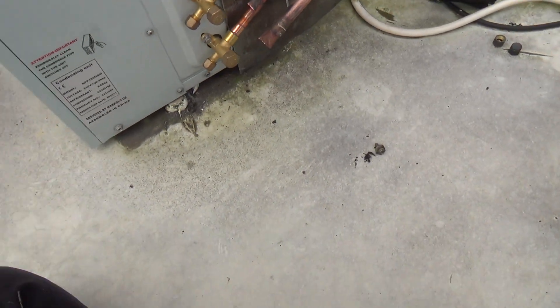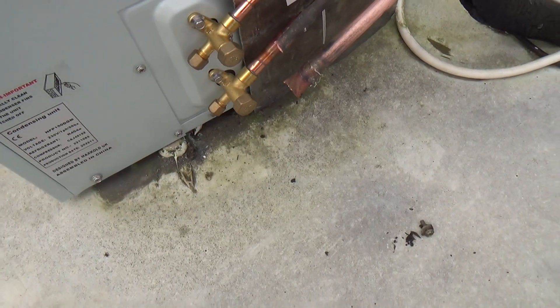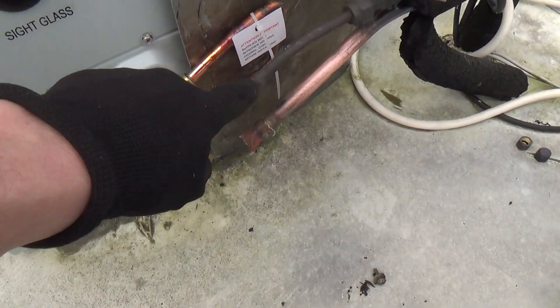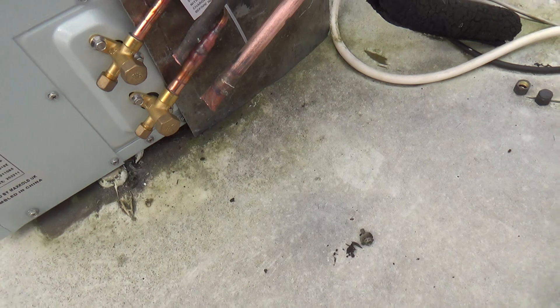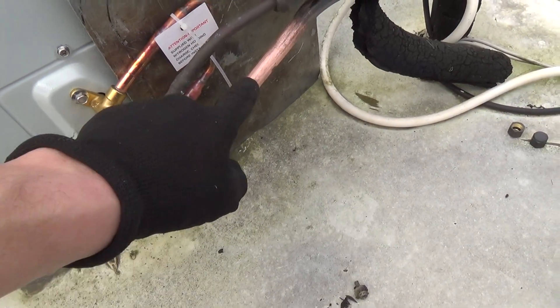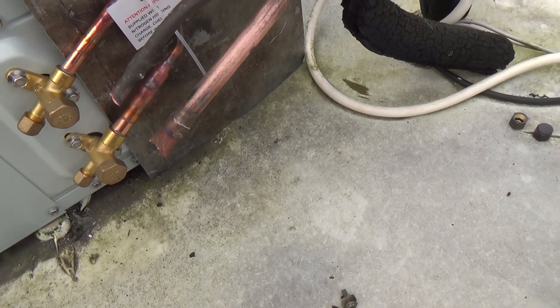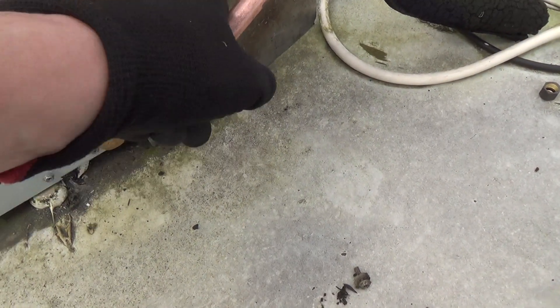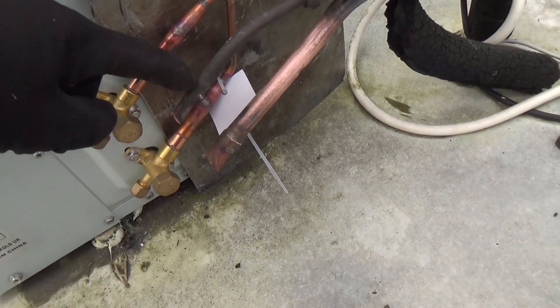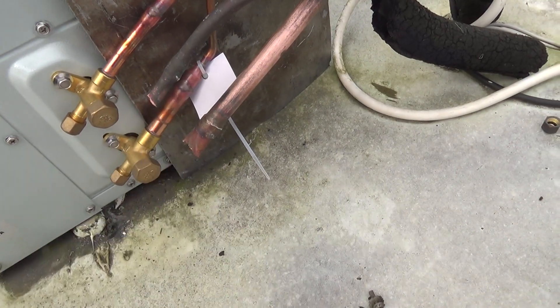Okay, that's the new one sited. I just cut through the pipes with these cutters — saves brazing them because I'm going to reuse that stub again, that'll probably fit in there. That one will have to cut it back because this is half inch and that's five eighths. It's a lot easier than unsweating that whole stub with the old valve on there. It's scrap anyway, so you might as well just cut them off with the cutters.